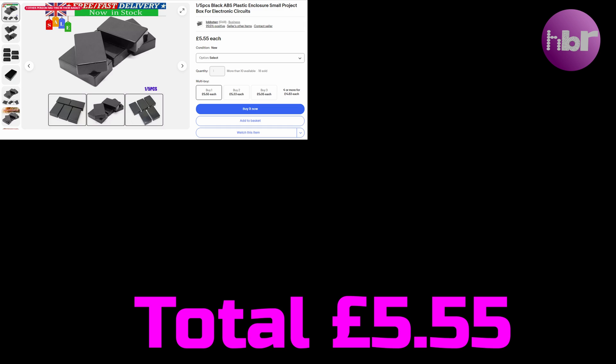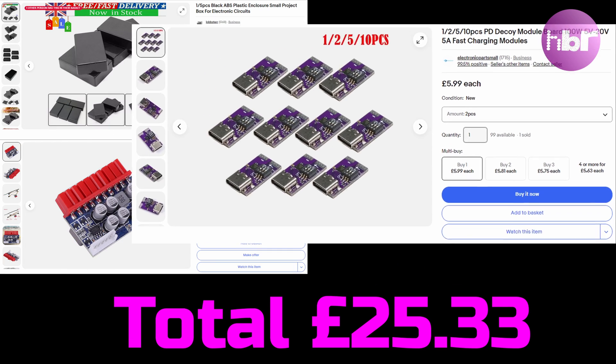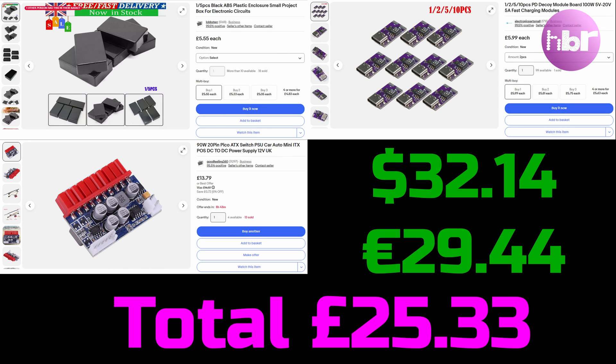The other thing about the Power Shark is that they are about 65 euros, and I don't think this is necessarily any cheaper — but if you already have an Amiga 500 power supply, you can reuse the switch and the cable, meaning you only have to buy the box, the Pico ATX card, and the little USB-C adapter that generates the 12 volts needed. All in all, if you've got an existing power supply, this is going to be about half the price of buying a Power Shark outright. The other problem is that currently they're not available — still waiting on the second run. If you're interested in the Power Shark, I'd recommend watching Rob Smith's video; he goes into depth on how the device works, the background into USB-C voltages, does a pretty good stress test, and it manages under- and over-voltage very well, shutting down and protecting the media in all cases.